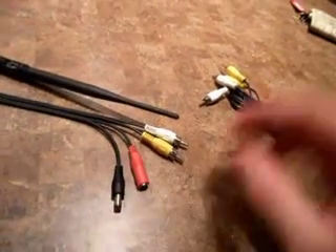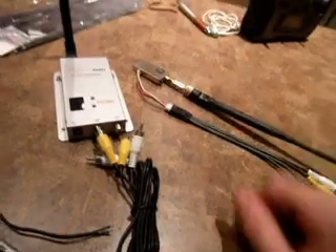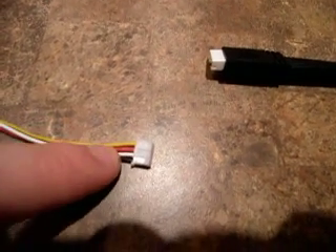Awesome. These are some cables they give you — your audio video that will go here. I do not plan to use this set of cables at all. What I'll probably end up doing is cutting off this connector here, because I need to splice in power from a battery, and I'll also need to splice in my camera that's still getting shipped to me. I'm probably going to take my splice here and put some kind of servo connector there just for easy disconnect. I've seen that done before and I thought that was a cool idea, so I'll probably steal that.